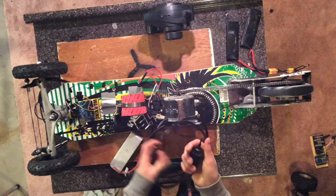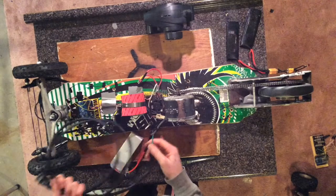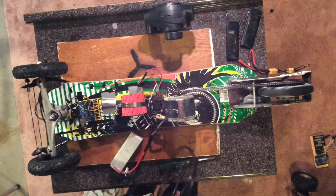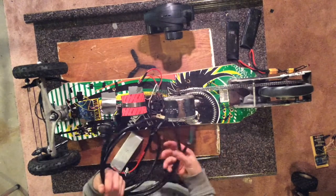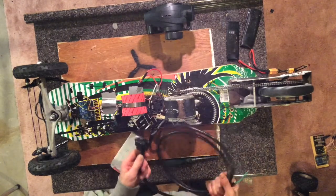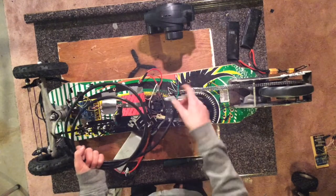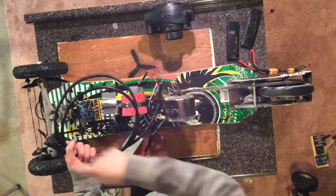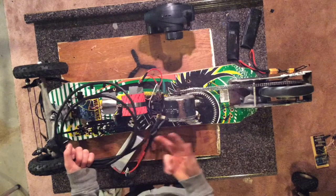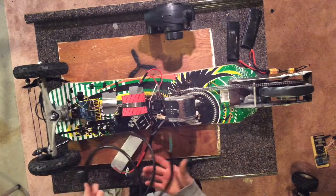It's a deadman switch, so you click it, it runs the motor with the switch in series, and when you stop clicking it, it just turns off the motor. Eventually I realized that this isn't a good idea because it's really inefficient. For one, I'm running this whole thing in series, so the power has to travel through the whole length of this cord twice because it's in series, which creates a lot of resistance, which is inefficient.